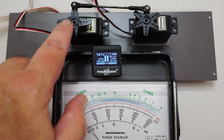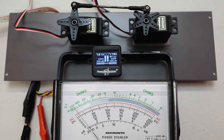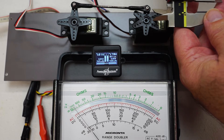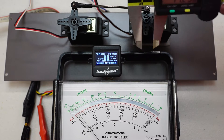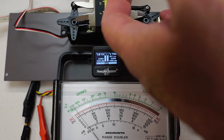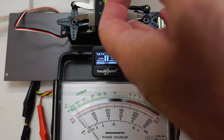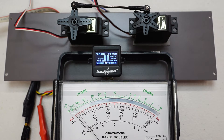I've got two different servo horns, so the balls are spaced at slightly different distances from the centre. Using my Mitutoyo calipers, you can see on the first servo — which is going to be my slave servo — it's around about 11mm from the centre to the ball. The other servo is around about 16mm. Because the balls are spaced at different distances, we're going to get non-linear travel between the two servos. I've set this up as a test jig to see how well the auto servo matching can cope with such a situation.